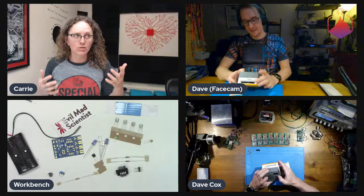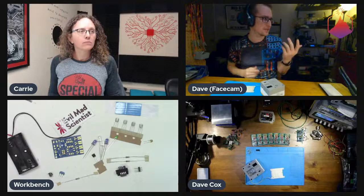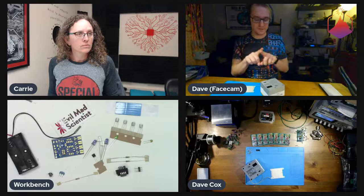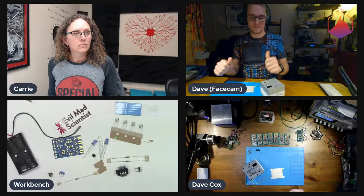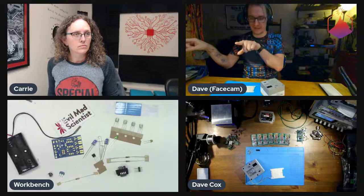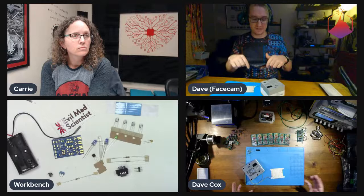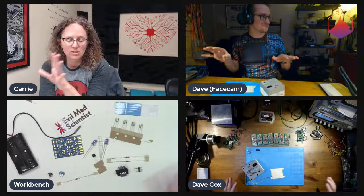What is the DMX system and protocol? It's so simple. DMX is RS485 — just a serial protocol also used for industrial control. It's literally RS485 at 250,000 baud. It's called DMX 512 because you send out 512 different settings one after another and just repeat that over and over. The lights listen for the start of the packet, find their address in the space, and set whatever they're doing — brightness or any actuator. There's no back-communication from the light to the board in most setups. It's basically dumb receivers.